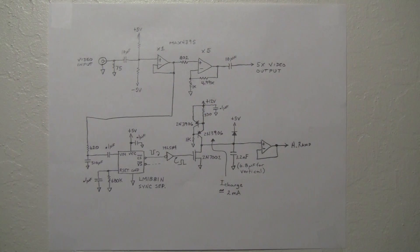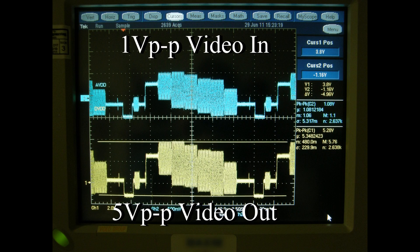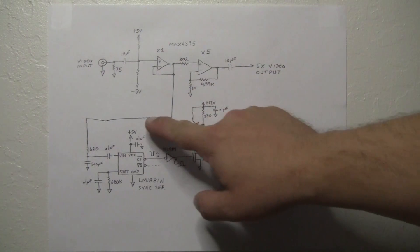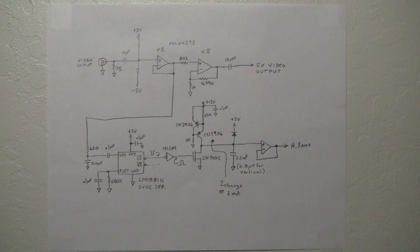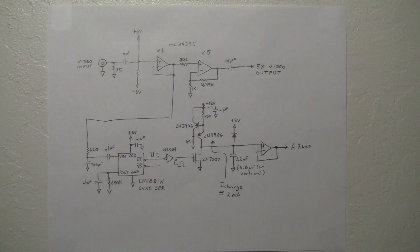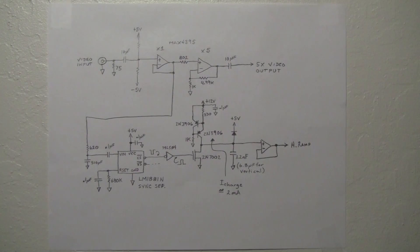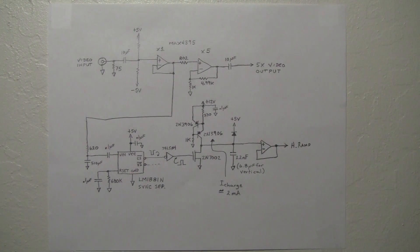This is the signal that drives the brightness on the CRT as it's scanning. Next I take the times-one video down into a National Semiconductor LM1881 sync separator IC — a wonderful little part that does the work of many parts. The video comes into a simple RC filter which attenuates the chroma signal, which in color video can extend into the sync region causing false triggering. The symptom is a hop in the vertical sync — the picture will hop up and down by one line and shiver. This simple filter knocks the chroma down without affecting the lower-frequency sync signals very much.